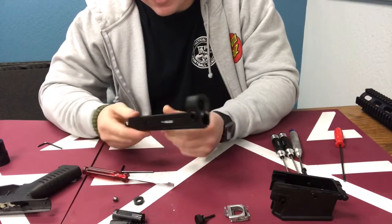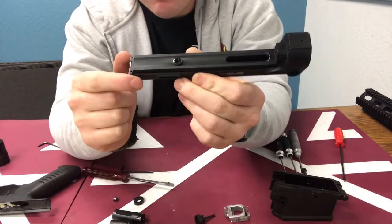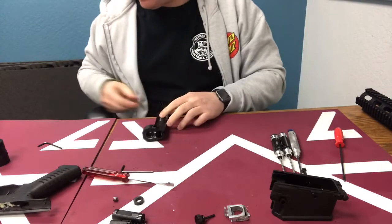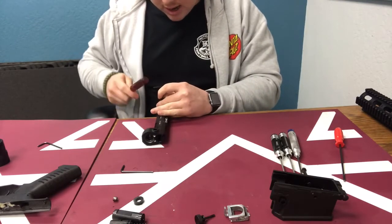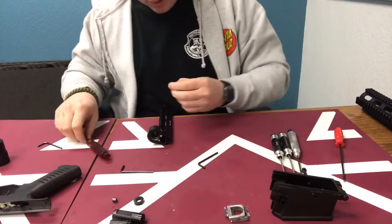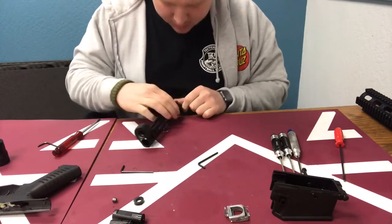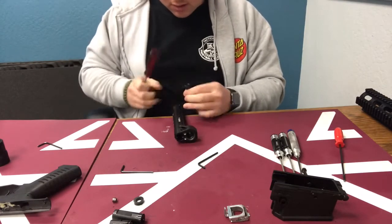Now we're going to get out that valve. There's a pin here that's holding in the velocity housing cover and we need to get that pin out. A lot of people forget that there's knurling on that pin — it's usually on the left side, so we're going to hit it out from the right. You can use a punch, an Allen key, or your locking pin, which I use most of the time. Looks like the knurling is on the opposite side, so I'll hit it from that side.